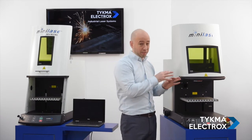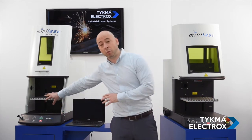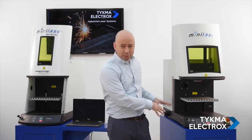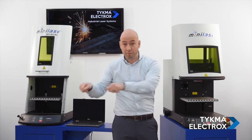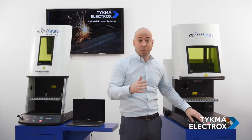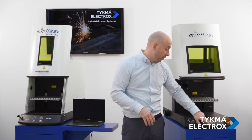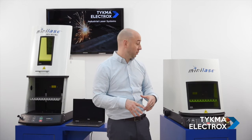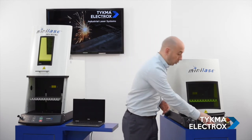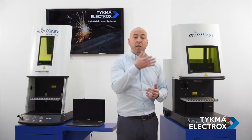The coolest thing about this auto door is it allows access from three sides — not only from the front, but also from the left and the right side. We do have operators who want parts on the left side of the machine that are unprocessed and parts on the right that are processed, so it's easy to work side to side with your workflow. The best thing from an ergonomic standpoint is an additional feature called easy mode. When I put the system into easy mode and press start, the door closes, marking engages, and when the marking is complete, the door automatically opens. For high volume, this eliminates the repetitive motion of the operator opening and closing the door.